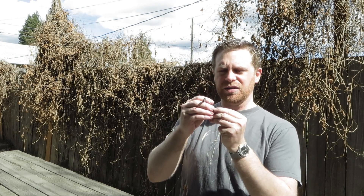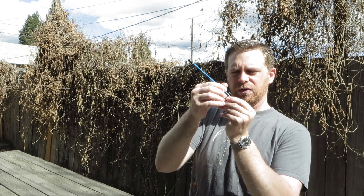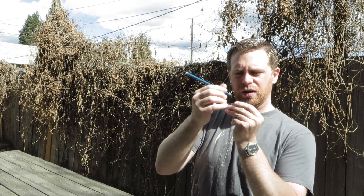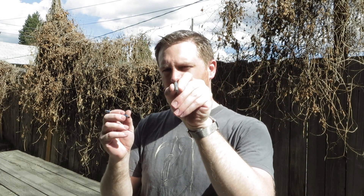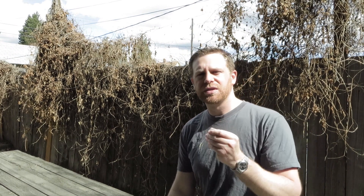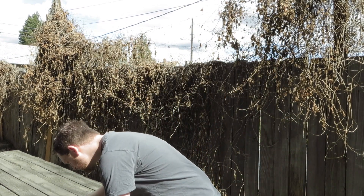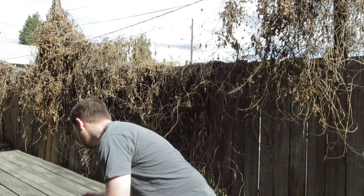The technique is you hold your pencil at a 45-degree angle to the surface and push with moderate pressure. If you can see, this one did not cut. We're not looking for it to scratch — we want it to actually cut into the material. I'm pushing down and forward while holding my angle consistent, using the same pressure with each pencil. That was number 6B, which is the softest.